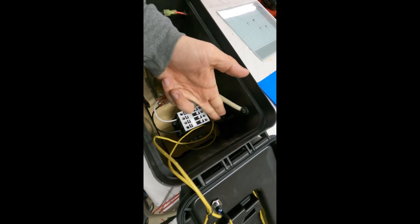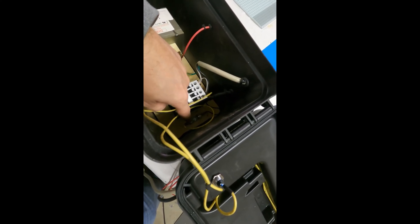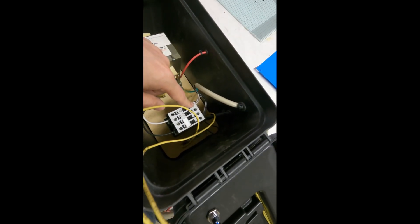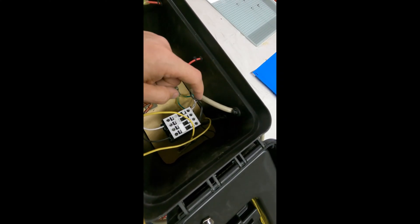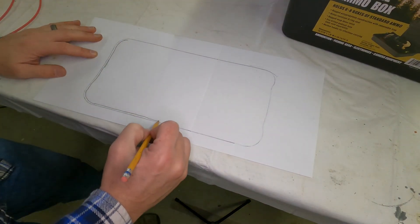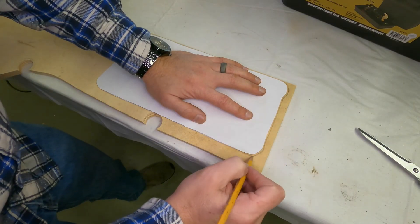The second AC power input down here is just to power the relay contactor. That line input goes straight into the fuse — that's the first place it goes. The wire goes from the fuse in series through both buttons, then to the coil of the contactor. This allows me to use both buttons. They both have to be pressed — they're normally open. When they're both pressed, only then will this pick and apply power to the microwave oven transformer. So let's get started.